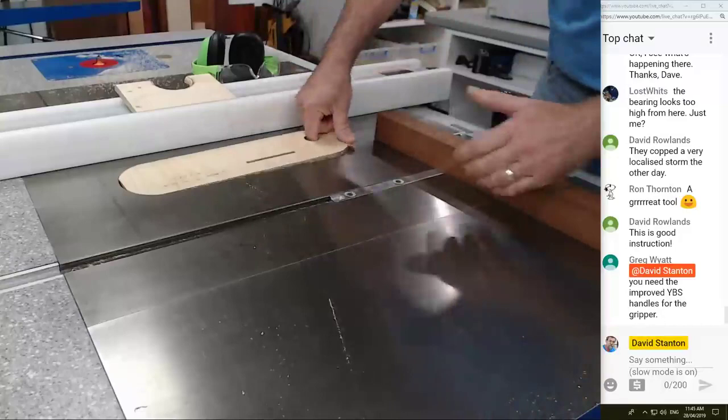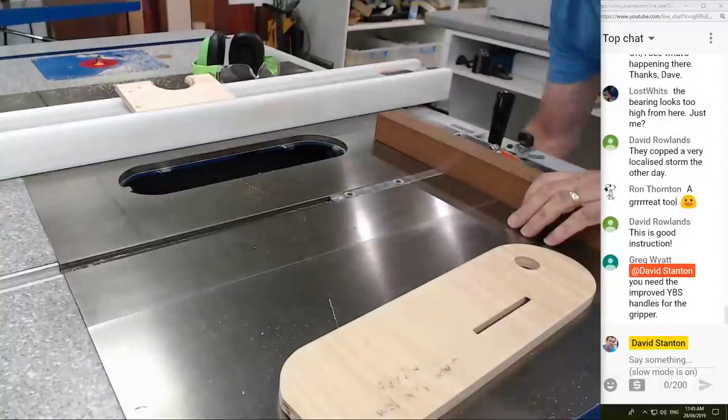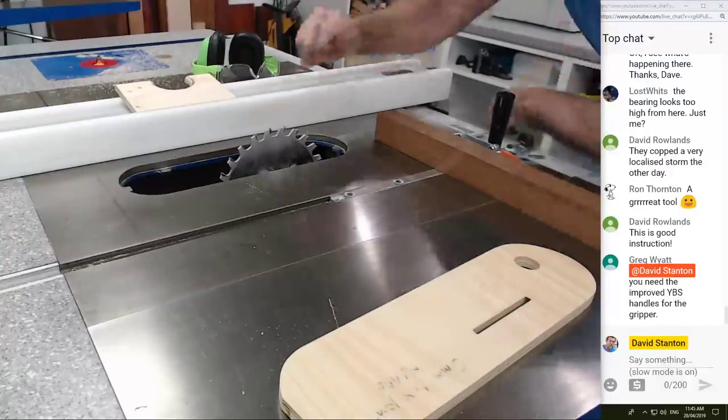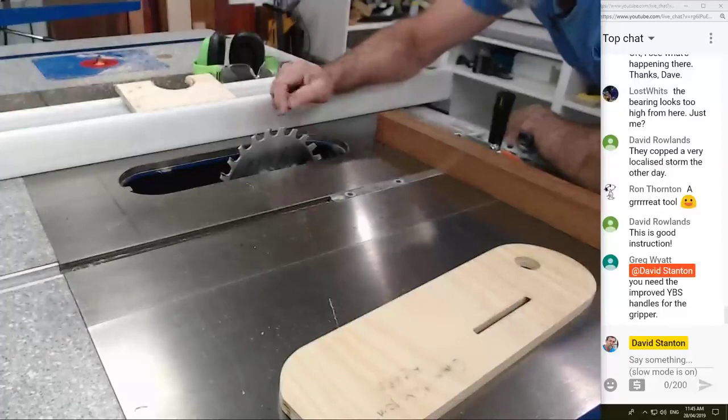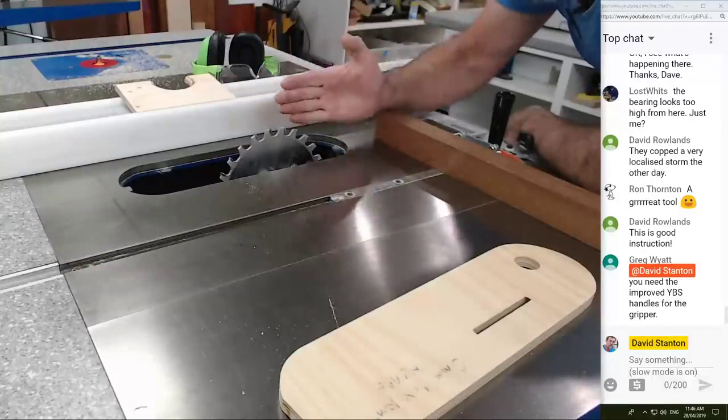Anyway, down in here, I have the Torquetta, and just making sure that everything's turned off there. This is my Torquetta box joint blade. Now this is a flat top blade, and I use this for small dados. This is if you've got a job site saw of some sort, and you don't want to put a very large dado stack in, you could get something like this, which is only 6 millimeters wide, and do increments of your dado or your rebate, and you'll be fine.